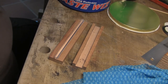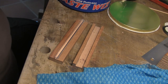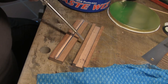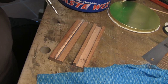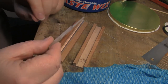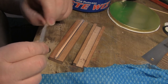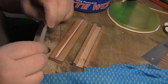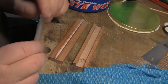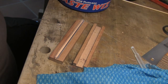I've done three coats of applied wax with wet gloss and buffed it up. I've done all the surface and just the two sides here, because I want the plaster of Paris to stay in here with the impression of that. Some good news on the epoxy itself — when I first got it out of the mold it was a little bit bendy, but a week later it's hard as a rock. Even this little thin bit at the end doesn't budge. So I'm very confident the epoxy is going to be okay, though I'm not too sure about the mold yet.